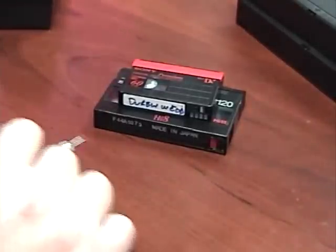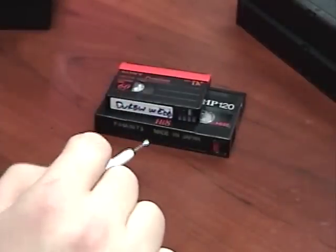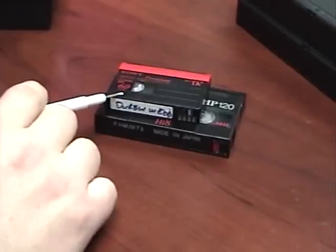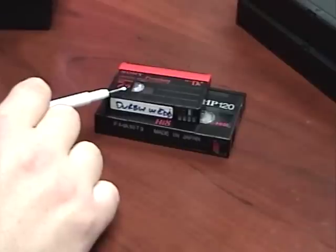To wrap up, I'll show you the features of a mini DV tape and an 8mm tape. The tape repair is basically the same — it's really fundamental. You just scotch tape the video tape onto the reel or splice it together with scotch tape. With mini DV, it is a little more sensitive. Some people think having tape on there can damage the video heads, but I've always done it and never had a problem. If you feel more comfortable, you can buy audio tape repair glue, but because audio tapes have gone by the wayside, you can't really find it very handily. Some Radio Shacks will still carry it, and you can actually glue the tape back together, but I've found that scotch tape works fine.